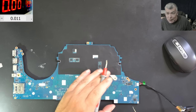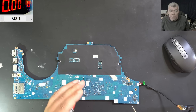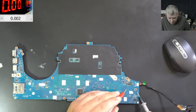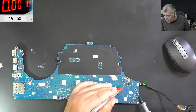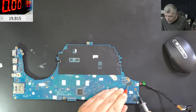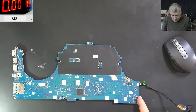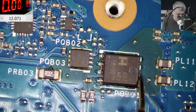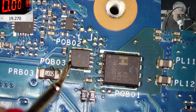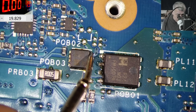It's not okay to lose voltage on a MOSFET — the resistance is very low, like 0.00-something ohms, and the MOSFET should handle over 50 amps. So why are we losing about 0.5 volts on a MOSFET? The MOSFETs are not shorted but still we are losing voltage. Looking closer: voltage coming in at 19.8, output of first MOSFET 19.8, then going to the second MOSFET and the output is 19.2. On the gate of the first MOSFET we have 19.8, and the gate of the second MOSFET we also have 19.8.